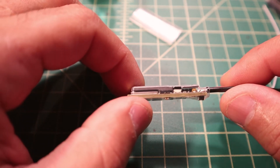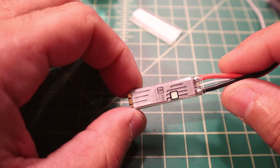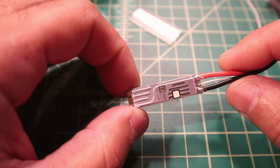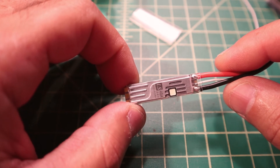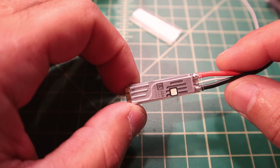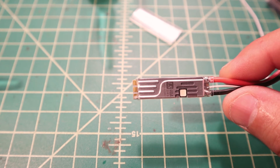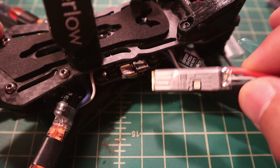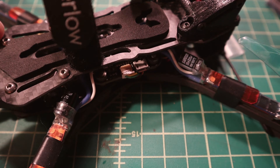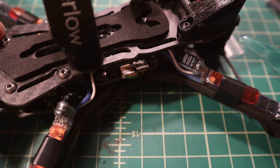They look really good. I hope they are basically a step up from the iFlights in terms of technology. I'm glad more manufacturers are catching up on this narrow ESC idea because it helps bring back the individual ESC for narrow arm builds that are so popular these days - so you're not stuck having to run a 4-in-1. I have nothing against 4-in-1s, but individual ones I think run better and cleaner. I run quads like this that have a very low deck, so I'm running a PDB and then the FC on top, and the PDB is so low profile that it works just fine.